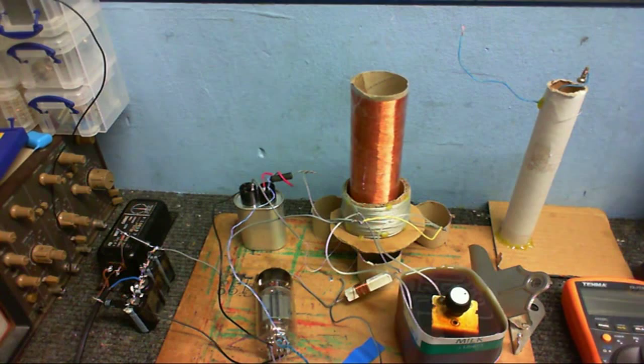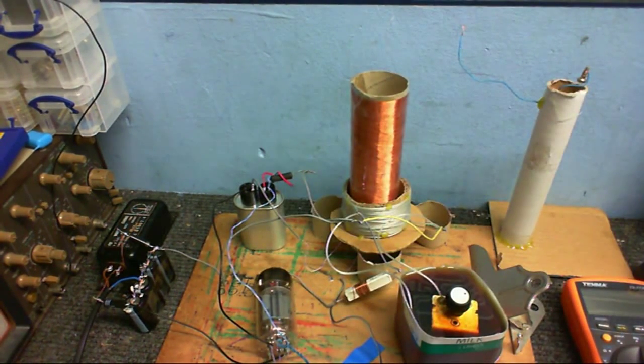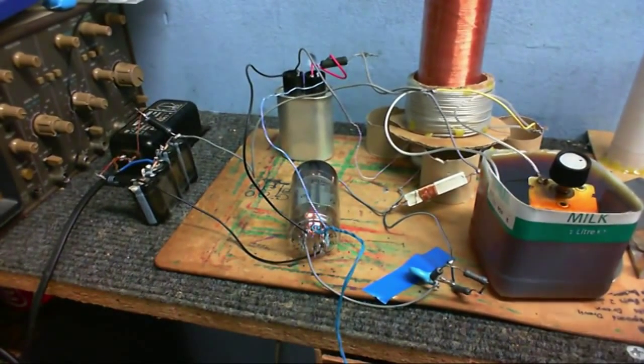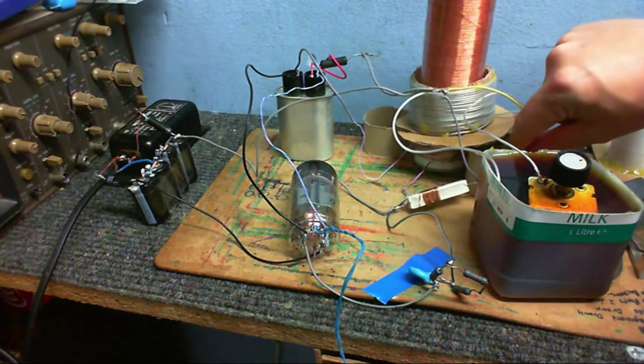The disadvantage is that there is no isolation from the mains. Anyway, I'm using one of those Russian clone PL-500 clones. But you might have noticed there's no feedback coil — where's the feedback coil? Well, there is a feedback coil. You can see underneath the secondary — the feedback coil is right there, wound onto the bottom of the secondary.